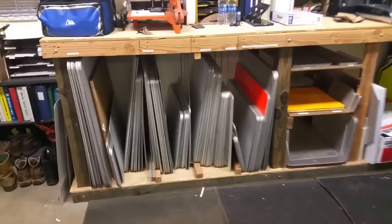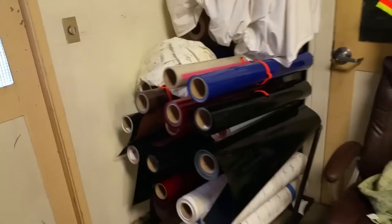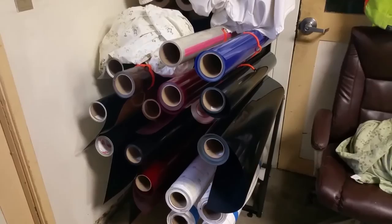Here are some more signs I've made that are going to be installed up in Circle Oaks — redoing the whole division. There's a yellow warning sign for railroad tracks. I use blank aluminum; the old signs are stripped and we buy back the aluminum at far cheaper cost than buying new ones. Here's my computer, my plotter, and my different rolls of EC film — the blue, green's in the machine right now, red for no parking zones, blue for handicapped. That's our sign-making capabilities in a nutshell. Thanks for watching!